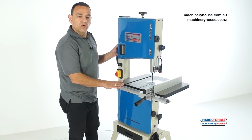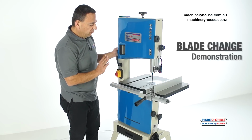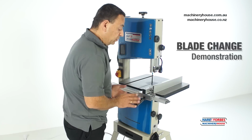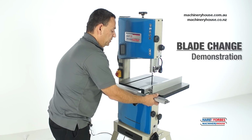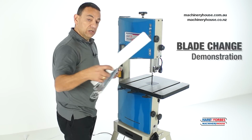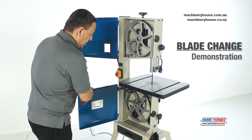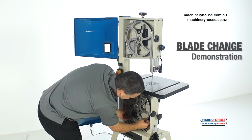I'll just demonstrate how quick and easy it is to replace the blade on this machine. But before we do that, as a safety, we must disconnect the power, just like so. Now, first thing we must do is remove the fence, loosening 4 little locking tabs underneath, and remove that in one whole unit. Open your blade guards and release the blade quick release tension. Now, it's simply a matter of removing the blade straight off the machine.